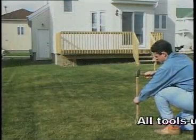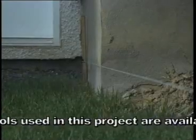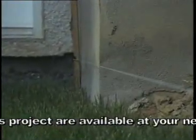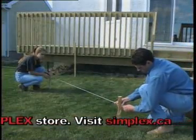Now that you have decided upon the location, size, and shape of your patio, use stakes and mason's string to mark out the location of the future foundation post. Mark the location of each post with a stake and connect them with a string so that they are aligned.